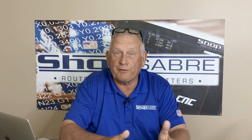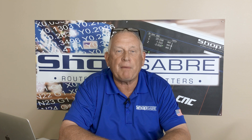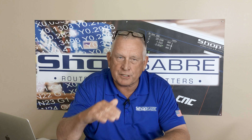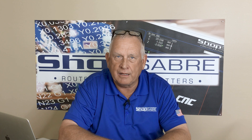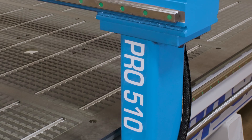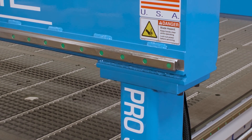What eventually led to our development of Super Z technology started as a project that involved maximizing gantry clearance on the CNC routers. It seemed obvious that the clearance under the gantry on a CNC should determine the thickest part that could be machined. If it fits under the gantry, you should be able to machine it. Well, it turns out that might not be the case depending on the length of the tools needed for the application.